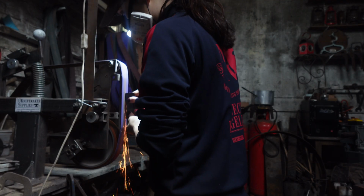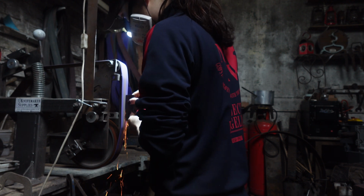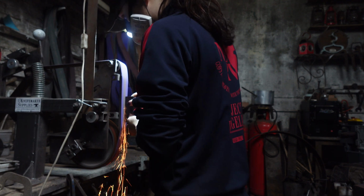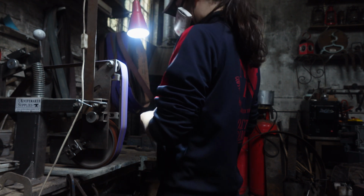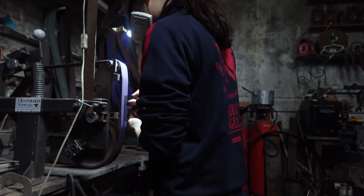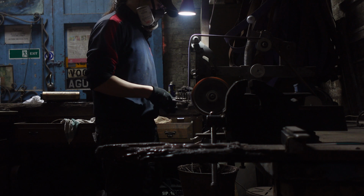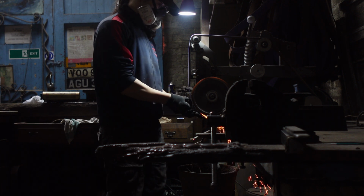After cutting these layers into similar sizes, I clean up the surfaces. You'll see that I started using clean gloves when I grind out the wider faces to avoid any oils from my fingers contaminating the welds.